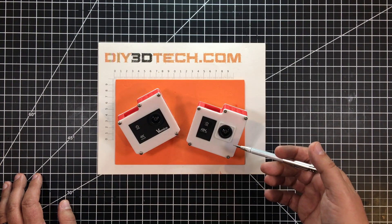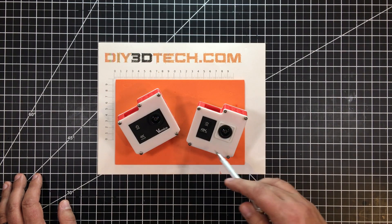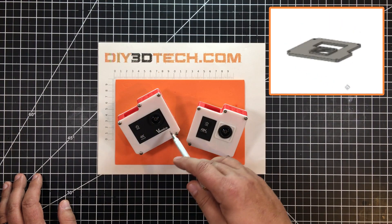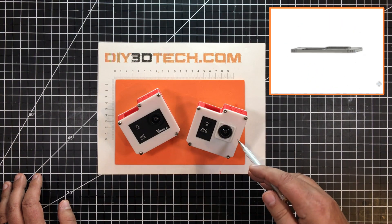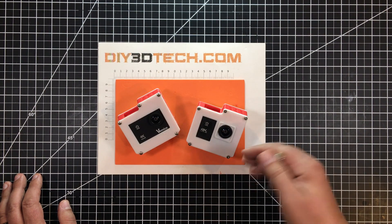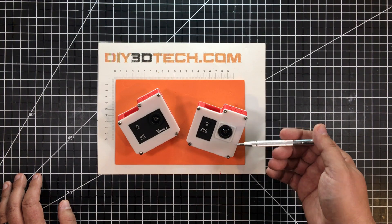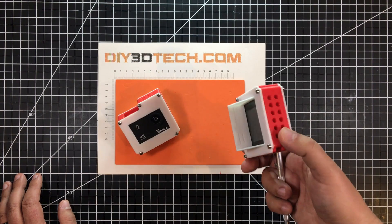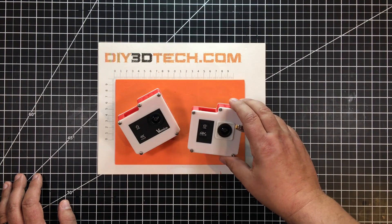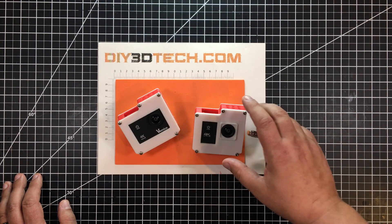In this version I decided to add a little extra protection by building a bump-out around the lens. Instead of having this open, it's now closed in — the lens pokes through and I have this bumper guard around it. It stands proud of the lens but not enough to cause vignetting, so it works out really well. Also, if you were to drop this — and I don't guarantee it — it obviously provides one heck of an OtterBox-like bumper guard to the camera, which is really utilitarian from a resiliency standpoint.